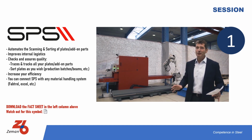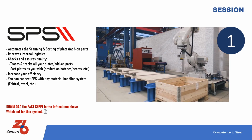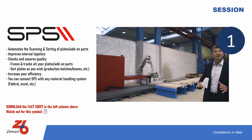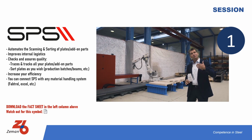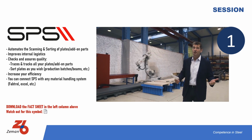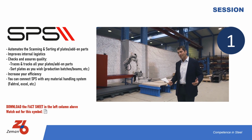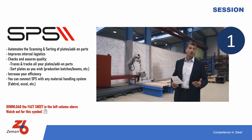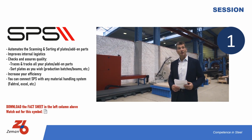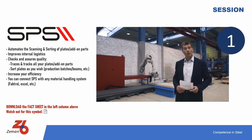So we are tracing each and every plate so that no plate gets lost. You might see here, maybe this plate goes to the fallback box. That means this plate has not been scanned properly. Actually, it has been scanned properly, but it has not been assigned to the production phase, to the batches, to the production sequences, or the major marks that you are doing. So tracing of the plates, very important. Some of our customers ask for an upgrade of the line, which goes into tracing by RFID or GPS data. That means you can trace all the parts moving around your overall factory.